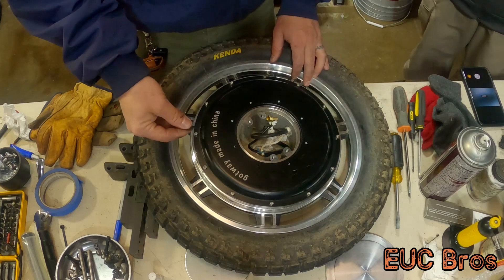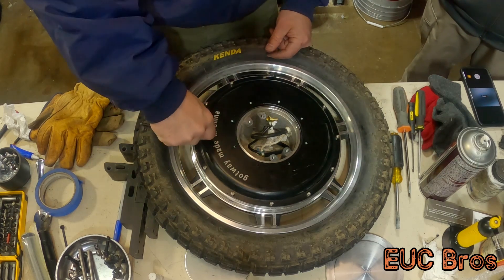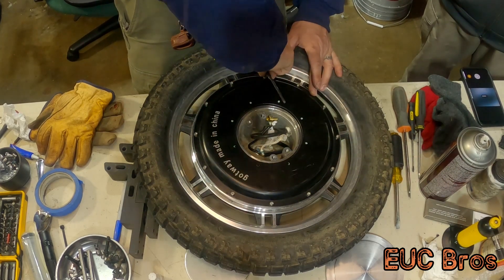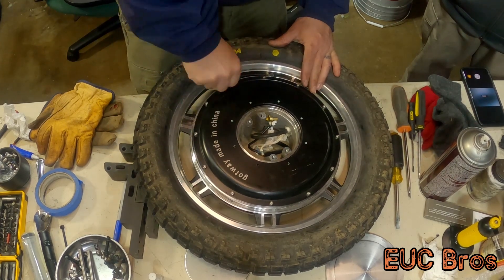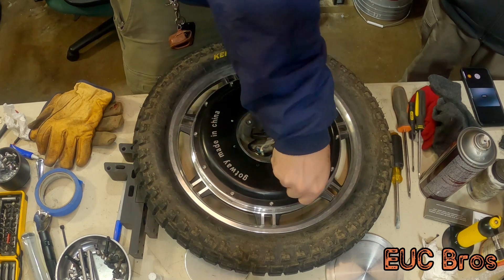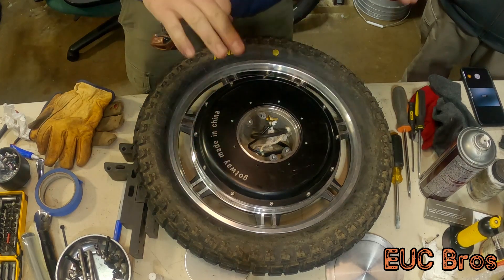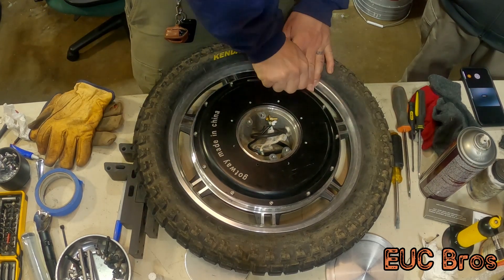These bolts are still pretty small, so when I go to torque them I never let my finger come all the way out on the wrench — I stay right about a little over an inch off the side of the wrench. Torque one straight across, torque the next one and go in a pattern. Once I get them all to a reasonably light torque, I'm going to go around and tap with a hammer, then re-torque them, tap again, and re-torque. Keep doing that until you can't get any more movement out of the bolts — that means you're seated flat all the way around. Don't over-tighten. The Loctite is going to keep them from backing off, so they don't need to be so tight they can't loosen — the Loctite will take care of that.